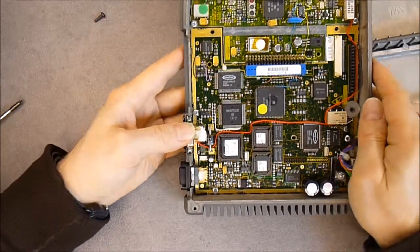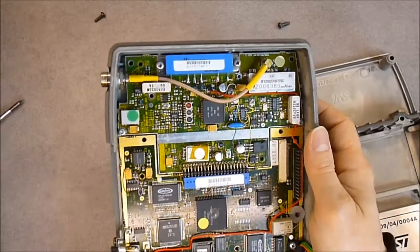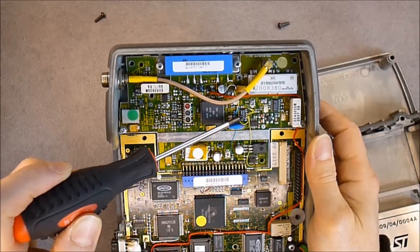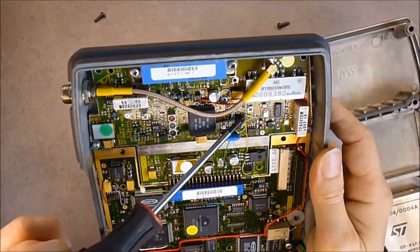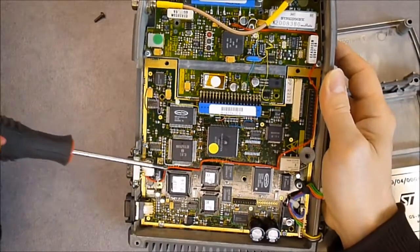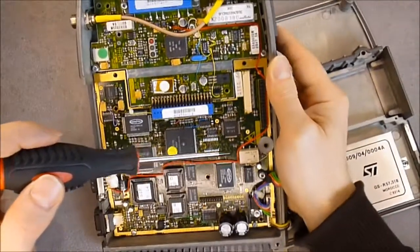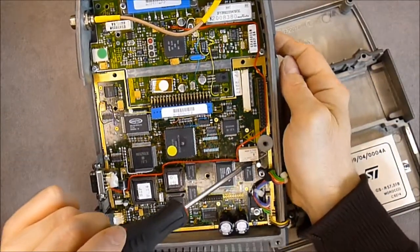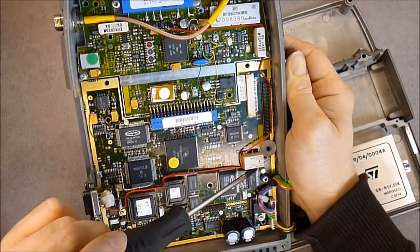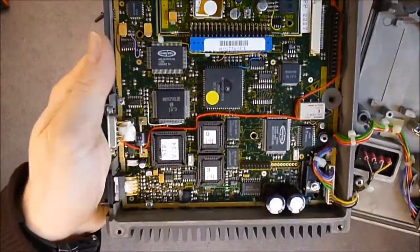And guys, I did not see it, excuse me. We have bodge wires, lots of them. Look at this, here, I'm going onto this little chip with a little surface mount cap here, floating around, going there, and here, more bodge wires, going to the rear side, this one, and here, not insulated bodge wire, almost touching this solder pad here. Very, very nasty work.